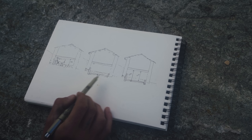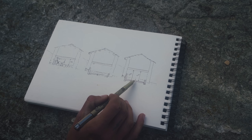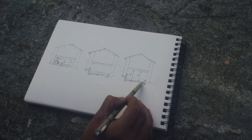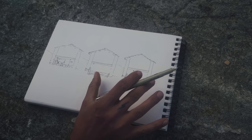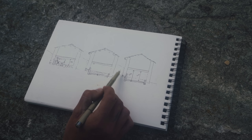And then eventually I want to have a final floor that is 2 meters in between the beams, so you can walk around easily without digging, which will be built out of gravel, insulation and then reinforced concrete. This concrete slab, together with these ones that go around, are supporting the entire building, basically kind of keep it pushed outside. Because if you wouldn't do this, you have exposed soil here for 0.5 meter, and with rain and weather it will eventually sag and collapse the building. So that's why the concrete is there.